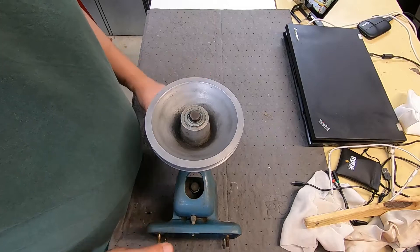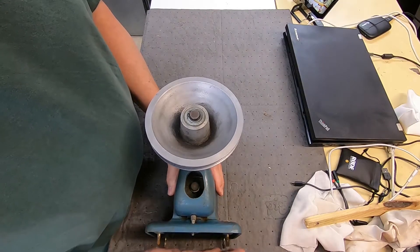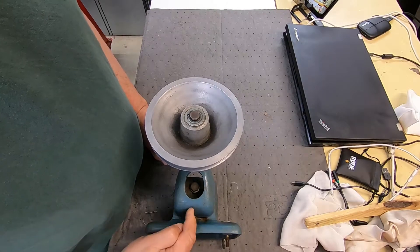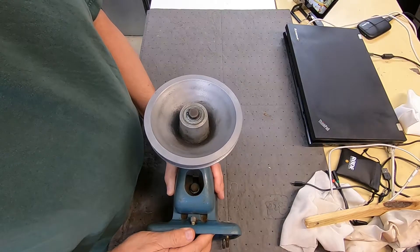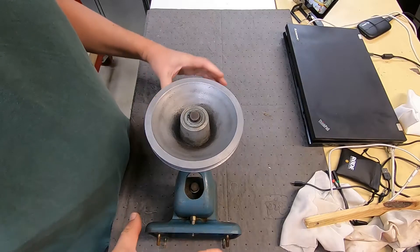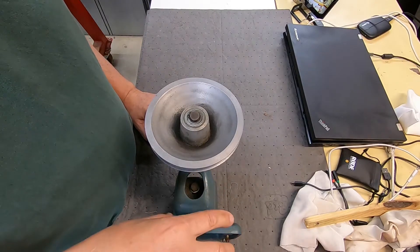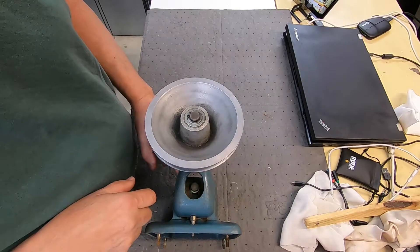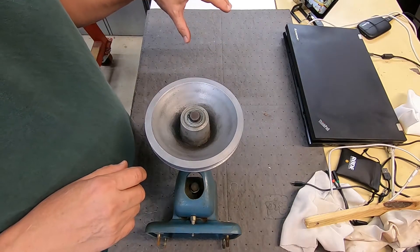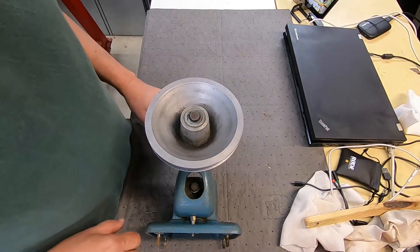Adjusting the belt tension originally - this block here would sit on the end of the round horizontal shaft of the radial arm, and the motor bolted on the back. There's a little grub screw type thing which bears on the back and this is how you could tension the rear of the two belts. It was a fiddly thing at best because there was a belt guard around it and another belt sitting over the top going from here to the motor. There wasn't any specific method for tightening the front belt - in my view a very poor arrangement.